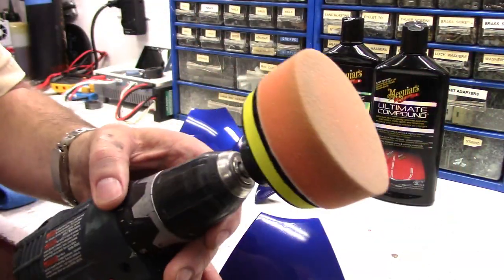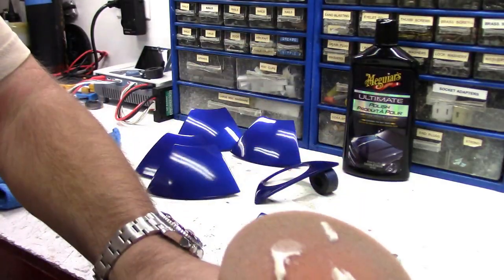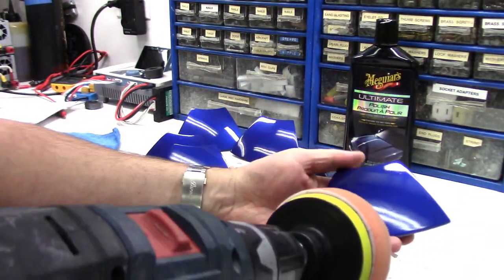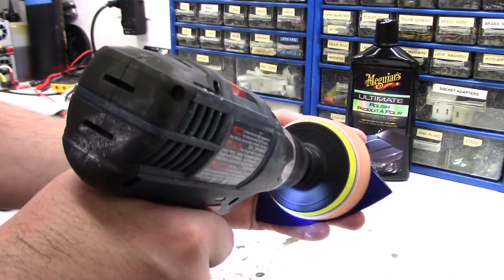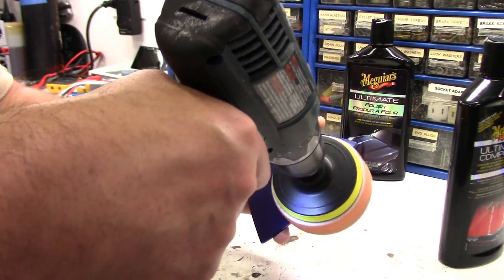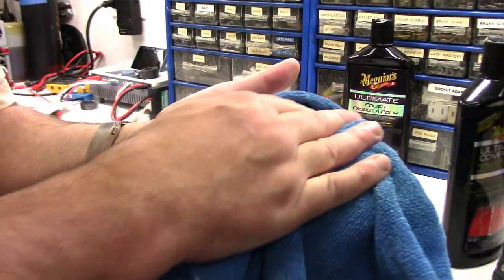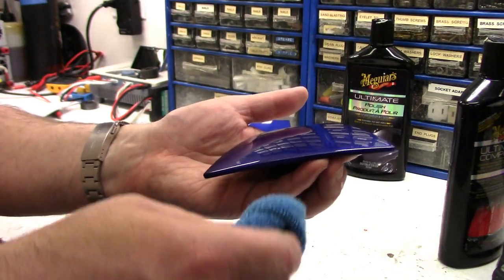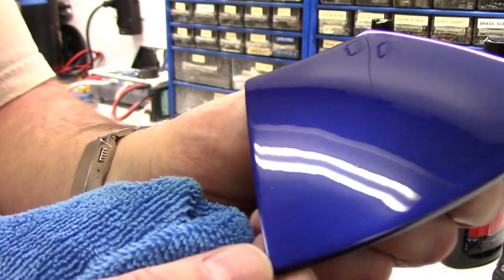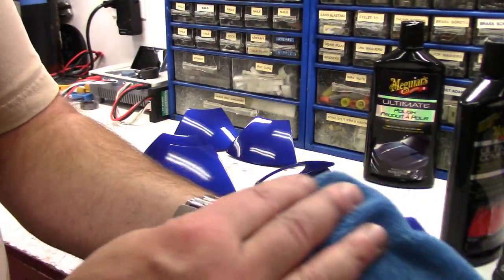To do that, I've got a little three inch polishing pad on a hand drill. Use whatever polishing compound you like — just put a little bit on your pad and rub it in. I should mention this clear coat has dried for about three days; you don't want to polish a fresh clear coat. Just worlds better — almost automotive quality. And that's even before putting the finer polishing paste on to really bring out the shine.